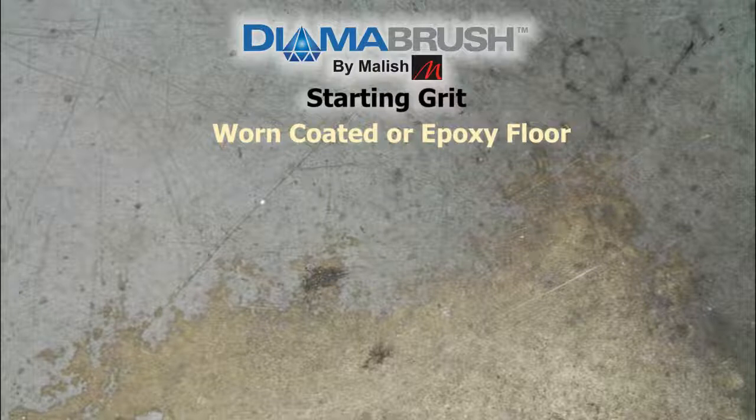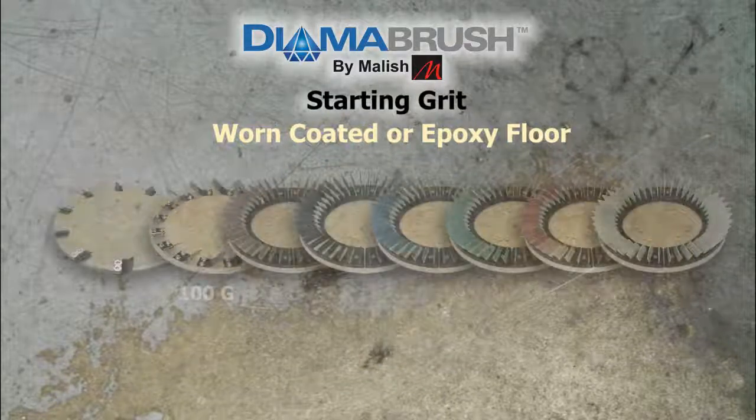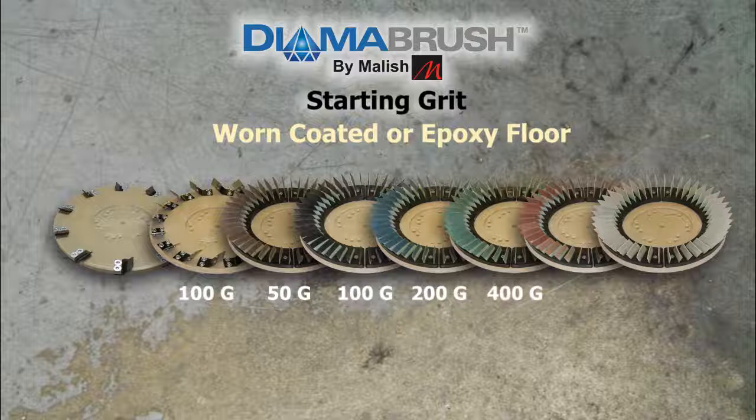1. If you have any type of coating or sealer on the floor, epoxy, adhesive, mastic, paint, or wax, you must begin with the 25 grit removal tool to remove the coating. You would then use, in order, the following tools. Either the 100 grit metal concrete prep or 100 grit metal concrete prep plus tools, the 50 grit polymer, the 100 grit polymer, the 200 grit polymer, the 400 grit polymer, the 1000 grit polymer, and finally the 2000 grit polymer tools.